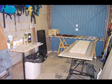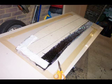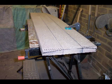Organise your workspace and pre-cut your carbon or glass. One of my tricks here is to lay up a fair big wodge of carbon down the trailing edge, foot and just at the front of the foil to take any knocks. It also allows you to shape the foil into the carbon.